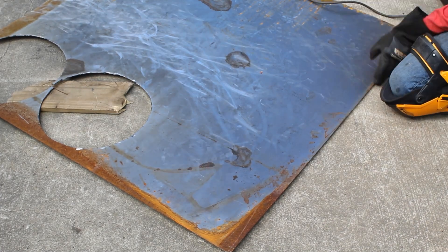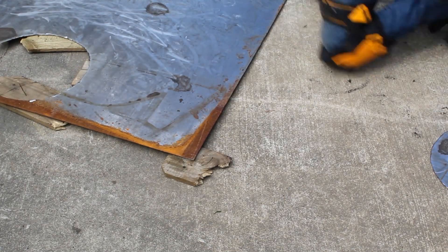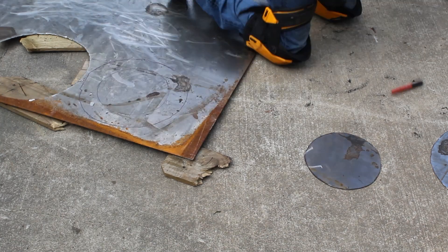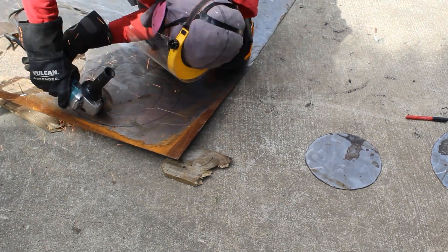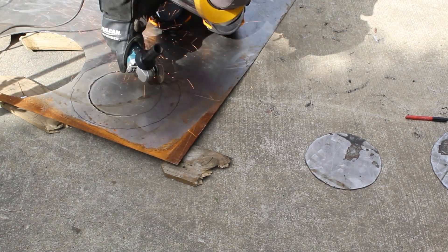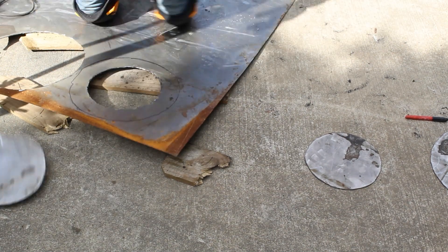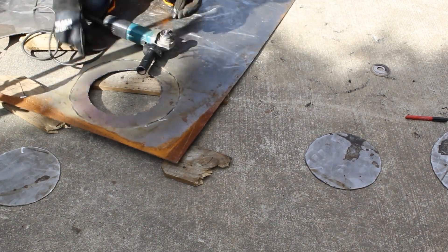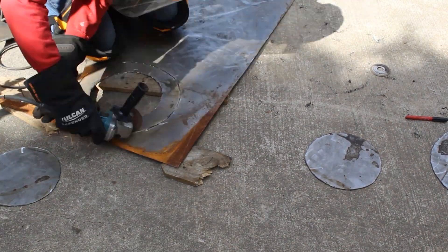Here's the truth — if I'm building this reactor by hand, putting on a shaft by hand, doing any of this stuff by hand without robots and machines, I can have the perfect diameter blades and still mess stuff up. That's kind of why we make sure they are pretty loosely toleranced. As long as the blades are hitting the belly of the machine, they're gonna move the plastic along.